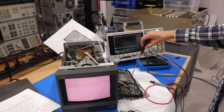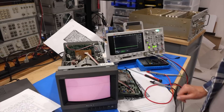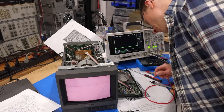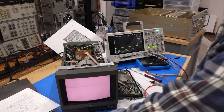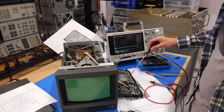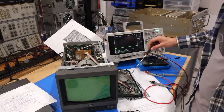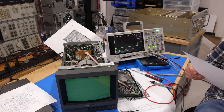Is there an experiment we could make by cross-connecting the two tubes? We could get less blue and less red. I don't think I have any control over red. Red is a reference — one of them is the reference. So I have blue gain and green gain, but no red control. We're hosed. We could artificially lower the blue — we do have a little bit of green, we just have so much red. I cranked the gain way up on green, that's why. Normally it's going to come out like this. If we had a way to lower the blue and the red — I can lower the blue, I just can't lower the red.